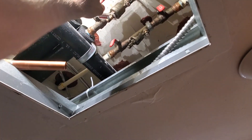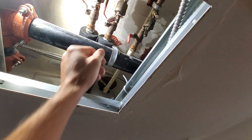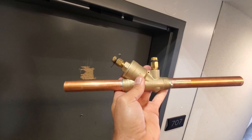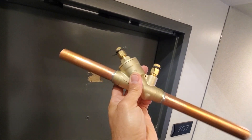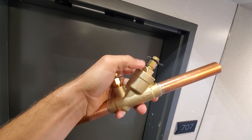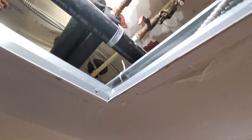They have these everywhere and they're all set to a 0.50 flow rate — the whole building, they're all 0.50. I ordered these from Griswold and they messed it up and sent me a 5-gallon flow rate. But I called them and they said okay, their bad — you can replace the cartridges right here. So they got those in the mail to me, and I'm going to install these today because we've got a building shutdown.